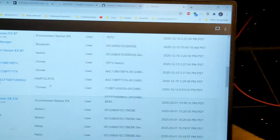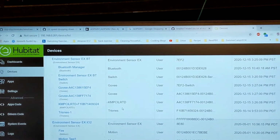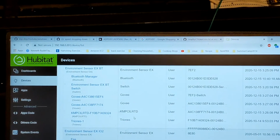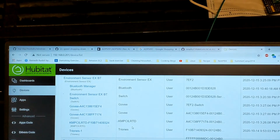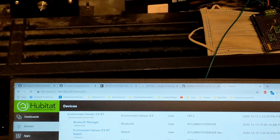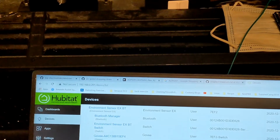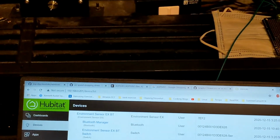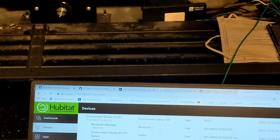Now, for the Zigbee use case, I'm designing something that, yes, draws power from this waste heat, but I'm gonna give a backup primary battery in case, for some reason, you need it. For example, when the power is off and all the repeaters are gone, Zigbee has an algorithm to look for new parents, and the energy generated from the heat probably is not going to be enough for long-term looking for a parent. So battery backup in that case is probably needed.